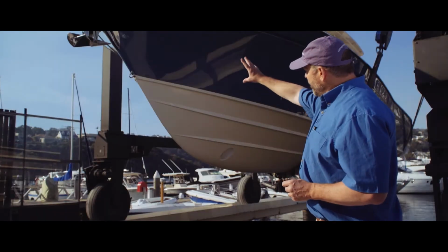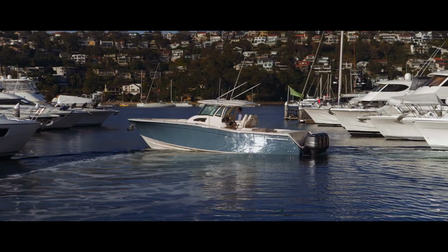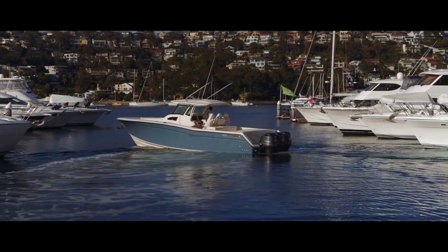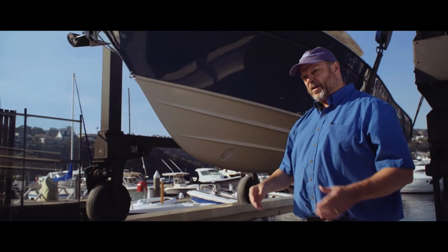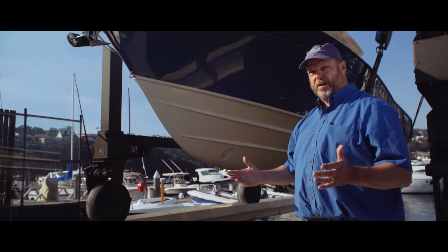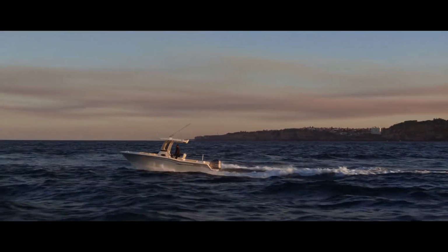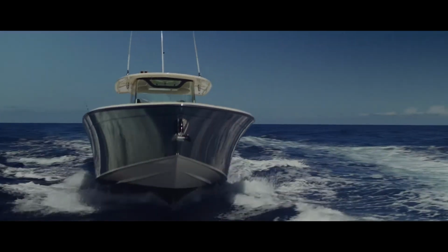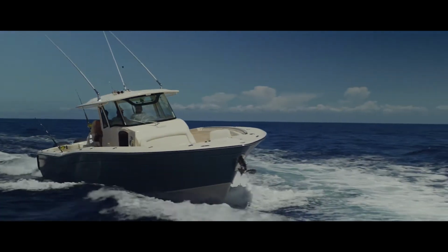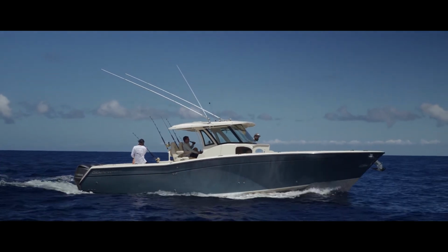You can see the flare up in the bow of the boat. There's an object lesson. If you drive around a marina these days, you'll see these boats with axe head bows. In other words, vertical plumb bows, no flare in the bow at all. They look cool. People think, man, that's what I want next. And they run very smoothly in a chop, going right into the waves because they have a very narrow entry, a very fine entry. But when you turn around and you run down sea in one of those boats, you're liable to bury the bow and submarine and come to a sudden stop. And so they're not good sea boats except for going right into the waves.